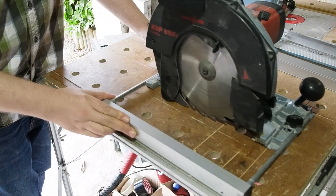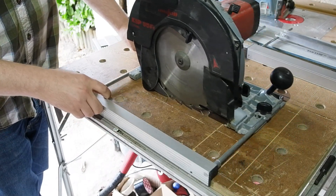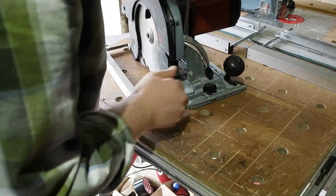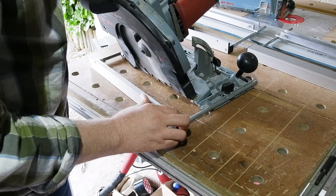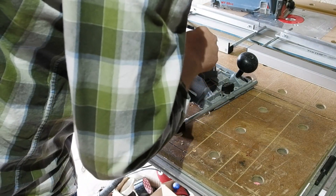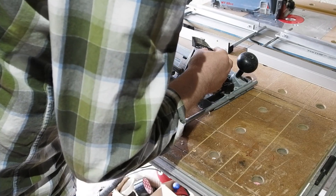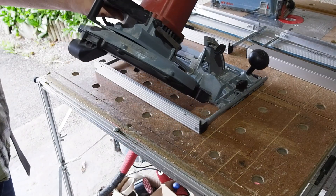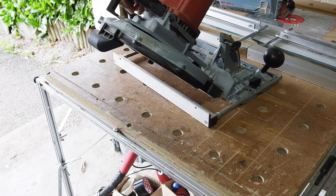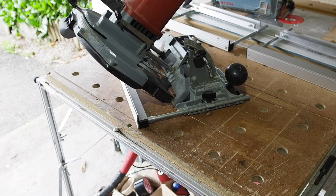Flip round, they sit below the base and run along the edge of a workpiece to guide the saw like any other parallel fence. Used in the orientation for stability — flush with the base — they're extremely useful for balancing the saw, particularly on hefty saws like my KSP85, the newer K85, or Festool's TS75, and especially at 45 or even 60 degrees of bevel on these bigger saws.